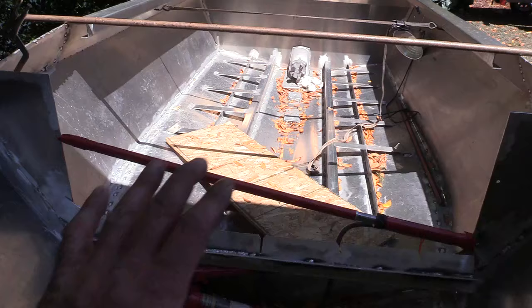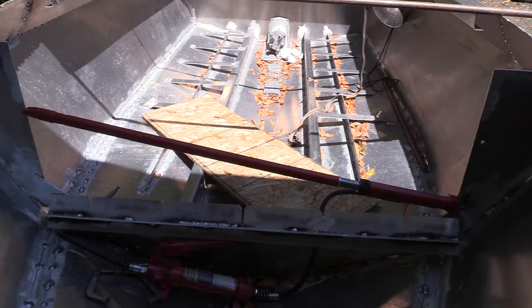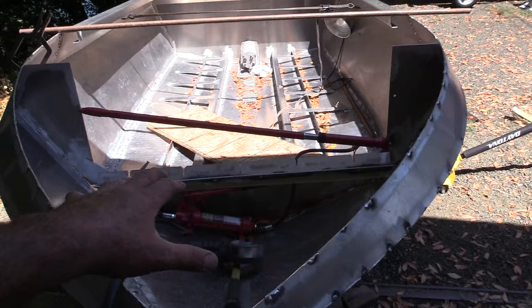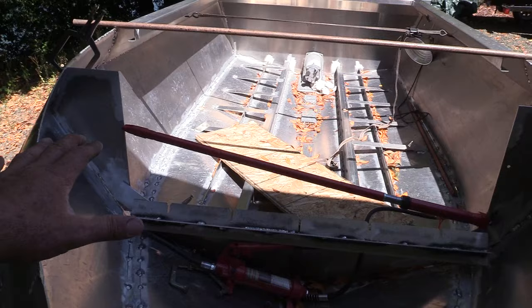And with the hood off, you can move this front end. When you have a good kit, all the bends are good, everything lines up. When you put your hood on, it should just fit, and you should be all straight and level. When you get to this point, all this bracing is due to having a twist down there that I'm making up for up here to make my hood fit. Obviously not fitting the hood in under tension like you would if you were building the kit normally.